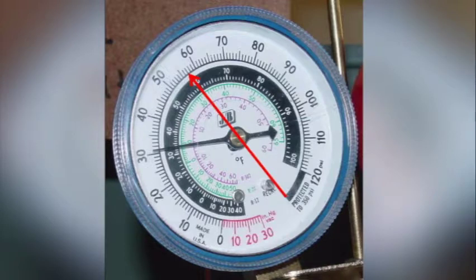So now, like we said before, if our suction pressure happens to be 57, the coil is going to be at 32 degrees. So that means it's practically freezing.